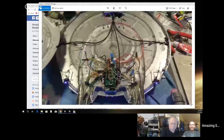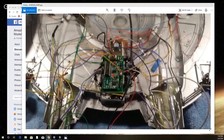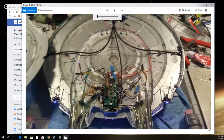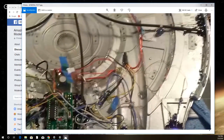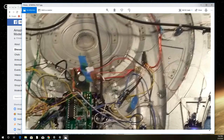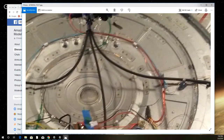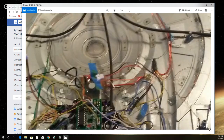Going back to the guts. The problem I always have now, his board here has, I guess, 20 gauge or 22 gauge wire that's insulated, and I use magnetic wire, which is even thinner yet. My problem has always been organizing these things and making it a real mess. So if you noticed, I got little pieces of styrene tubing to act as conduits to keep the wiring organized. Yeah, I'm gonna steal that from you, Jack.